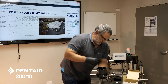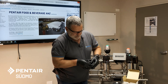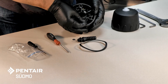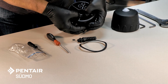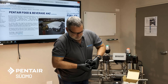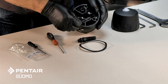We've now got to work these o-rings into this gap. Make sure your fingers are nice and grease-free. If you lubricate this o-ring you'll be here for half an hour, but if you do it dry, that o-ring will work its way in — it takes a minute or so just to work it into that shape and get it to stay put. The other o-ring will sit in there the same way.